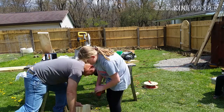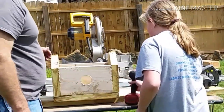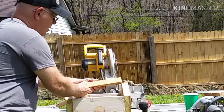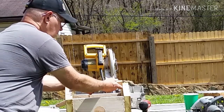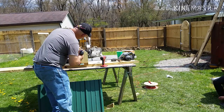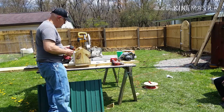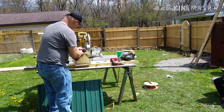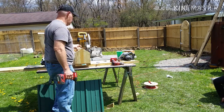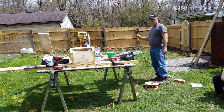Now we have all the walls and floor put together — all we need is a roof. I've cut a piece of two-by-two to use as a ridge support, and we'll add a three-inch screw on either side so we don't have any roof sag. This is also the home of Hitch-a-Chick Urban Homestead, so there's no shortage of miscellaneous supplies. For cutting the metal roofing on a small project like this, I find the angle grinder works best.